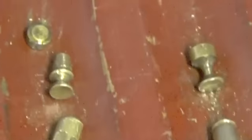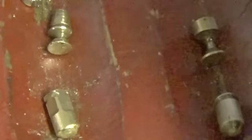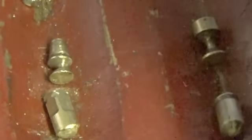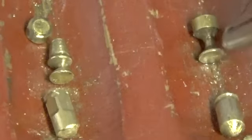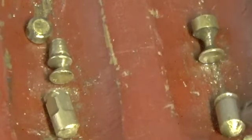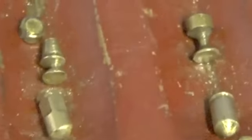Now number five and six. On number five, there was a serrated key pin. There was a wafer on top of this weird type of T-pin — it's got like a spool T-pin with this wafer on top of it. And this is another weird type of spool, cut way down to where it would catch on the ledge of the lock. And this is a key pin, serrated. That's what we have in this ASSA challenge lock number five.